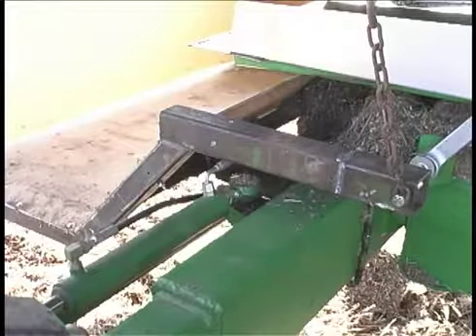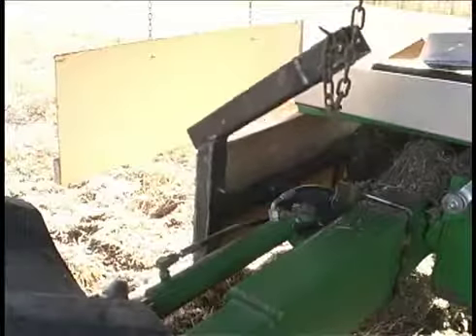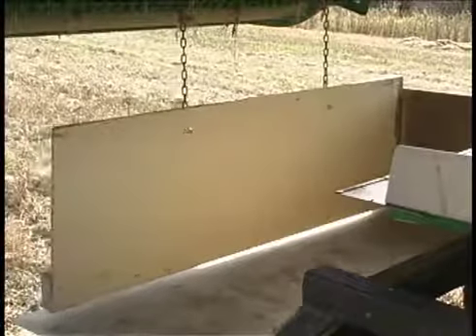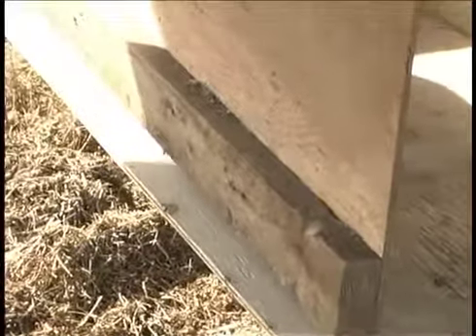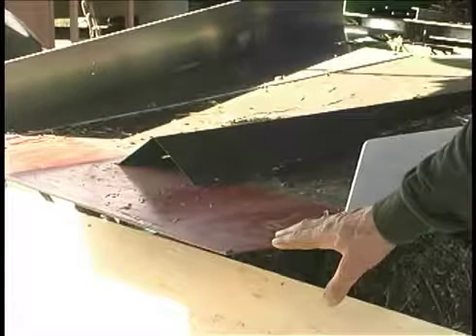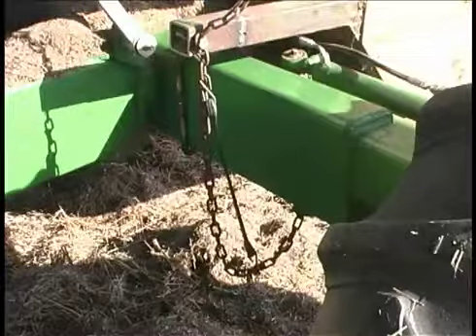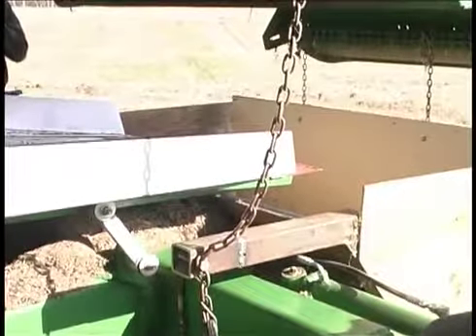Notice the angle of the counterbalance weight arms. These are built at an angle so that none of the frame weight passes by the hinge point as the box tips. This is not essential but is highly recommended for better functioning of the units. The back door is simply dangling from the combine housing. The 2x4 wood block is nailed on for extra weight and to keep the plywood sturdy. Notice the chaff pan extension that carries the material back to the hinge point of the box — it also prevents chaff from getting underneath the box as the unit is tipping. This chain keeps the box from tipping too far and this chain keeps it in place when reset.